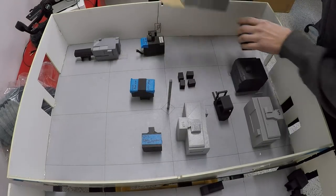We're not 100% sure where it's going in the shop, but we want to plan on never moving it — it's a big, heavy machine and effectively three separate machines: the APC, the tool matrix, and the actual horizontal. Moving it is far more complicated than a vertical, which we can skate around and re-level ourselves. This machine has to be bolted to the floor because of its speed — something like 2,300-inch rapids — and all three components have to be bolted down and aligned relative to each other. We've been using a 3D printed layout of our shop to test placement from a flow standpoint.